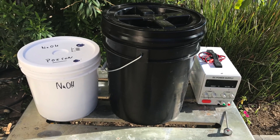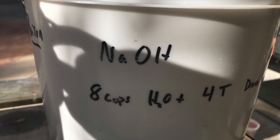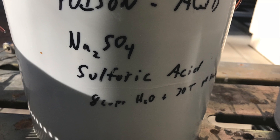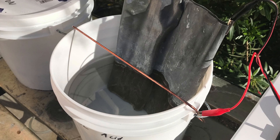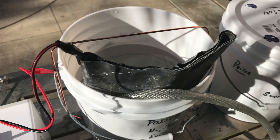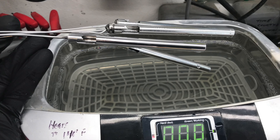Here's my setup — two buckets and a power supply. The ratio is 8 cups of water to 4 tablespoons of lye for the etching, and for the sulfuric acid it's 8 cups of water to 30 tablespoons of pH down. Here's the lead sheet in the bucket set up in the solution of acid, and I put a little air hose in there to agitate the solution.